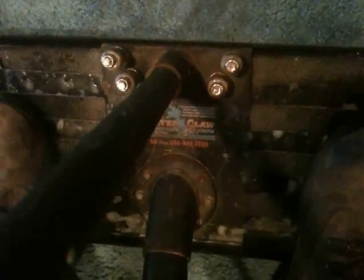We move this across the carpet — you're supposed to wait about eight or ten seconds in between, and do it a couple of times. You do this two or three times and it removes most of the moisture from the carpet and the pad. This works fairly well; it's one of the best methods in the industry for saving carpet and pad. It's very hard to see the water in the carpet, but it's amazing how much actually comes out. We keep doing that until we can't find any more moisture, then go over this with a light wand to extract the top of the carpet.